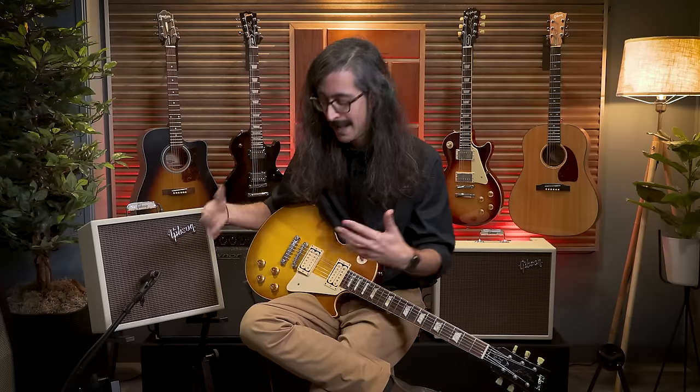This is very common for single tone control type amp circuits. It's letting more signal pass through to the rest of the circuit, as opposed to rolling off all that high end, all of that bite that really overdrives the rest of the circuit. So on this amp, if you want more gain, just roll up the tone control as well as the volume. And you can always balance that out with the tone controls on your guitar if it's too bright for you. That's a great way of doing that.